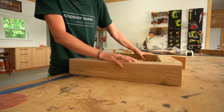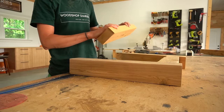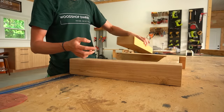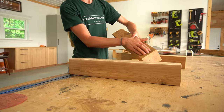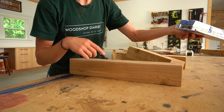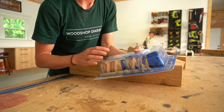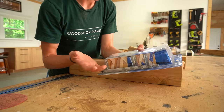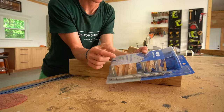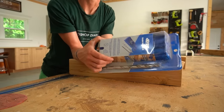I have all my pieces here to make one side of the sofa: the top piece connecting between the two legs, and the seat support connecting between them halfway down. I'm going to use pocket holes on the inside piece so they'll be hidden, and also on the bottom side of the top 4x4. Since this is a 4x4, the regular pocket holes won't work. This video is not sponsored by Kreg, but they sent me this extra-large jig a while ago — it works with 2x4s and 4x4s, though 2x4s also work with standard pocket holes. However, 4x4s do not, so I'm going to break this out. It's basically just a giant version of the regular size 320.